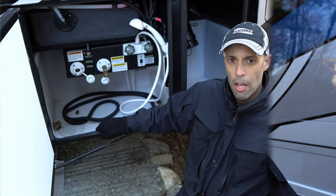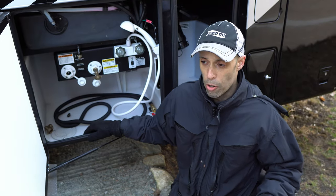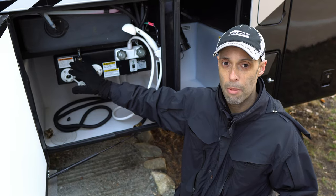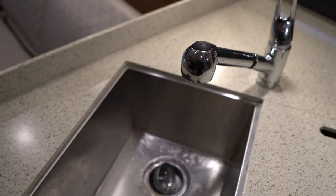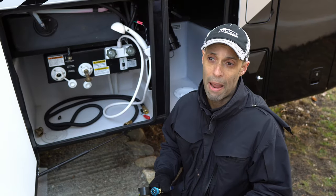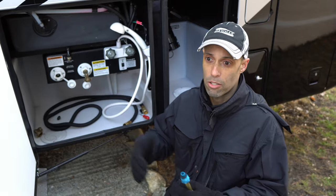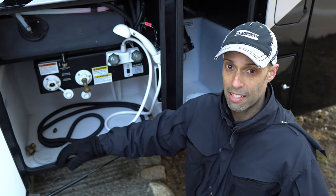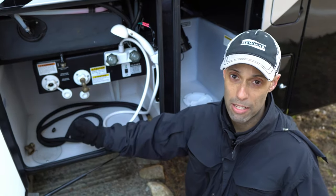All the activity is going to take place in your wet bay. The first thing you want to do is push air through the system and blow out any fluid that's in the system. I usually set it to around 45 to 50 pounds. Open up all your faucets, let whatever comes out until it's misting or just air, then shut everything. The second thing you're going to want to do: there's a screen in this little check valve, and you're going to want to pull that screen out.